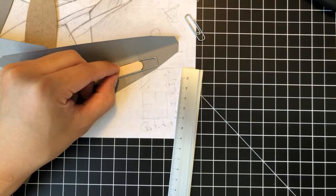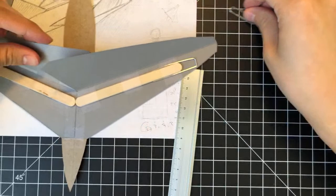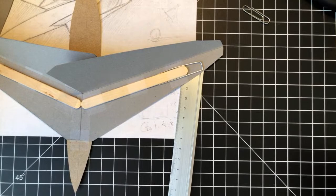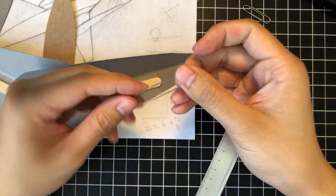It's gonna be kind of tough to integrate a propulsion system into an aircraft at this scale. It has to be super lightweight, because the propulsion systems at this scale are rubber bands, right? So you either need a super light airframe with balsa wood and film, or you need a styrofoam professionally molded design with a battery and all the ESCs and stuff like that. Yeah, so not quite at that level.